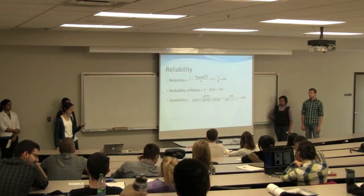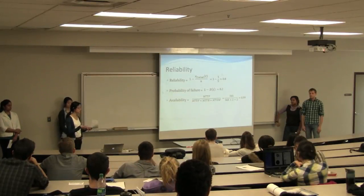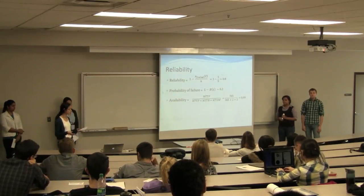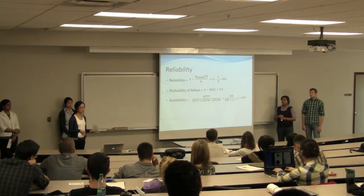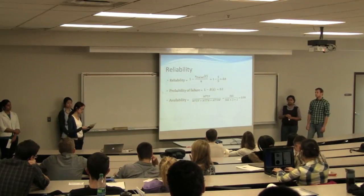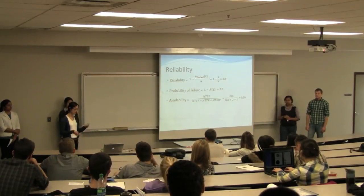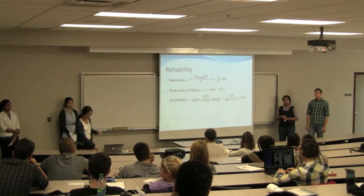For the availability, there's a backup ozone generator. So the first generator, if that fails, then it will be inspected and fixed within 1 to 2 days, assuming there are parts available from the supplier. So availability will be 0.99. Even though this value is pretty high, they still need to maintain, keep track of equipment and make sure it's going okay. So it would implement redundant safety level alarms, make sure the composition levels are okay, and preventive maintenance to ensure each equipment's function.